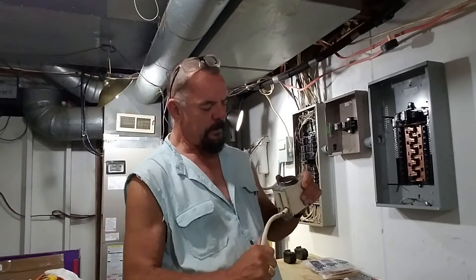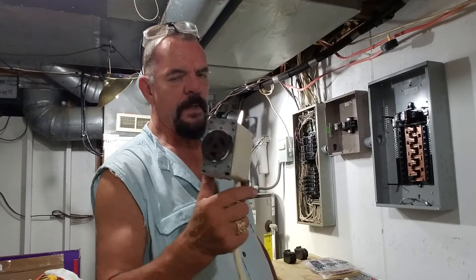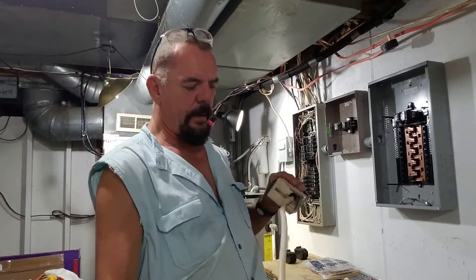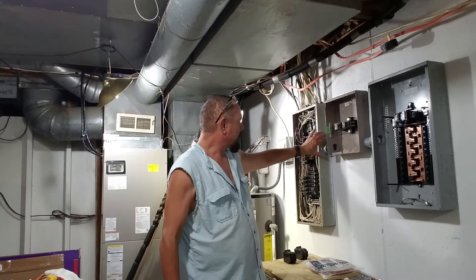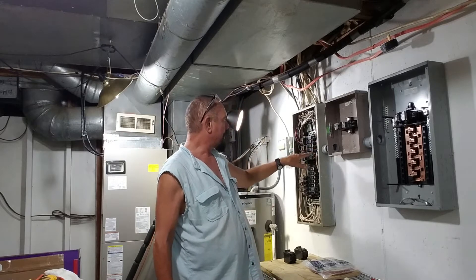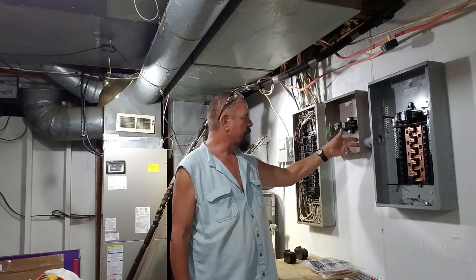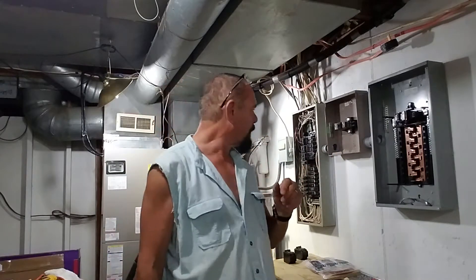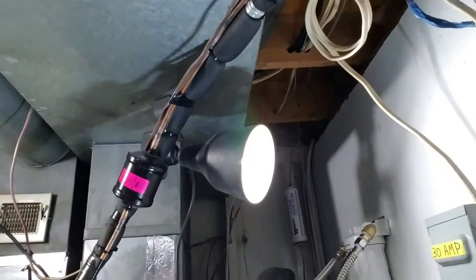I don't know if he used it to back-feed or to put energy out to the garage — Romex 10-2 or 10-3 or whatever it was I've got up there. This thing here was piggybacked on a 30-amp breaker and I said, that's going today while I'm in this box, because I had to get in there to drill a hole. There was no knockout in that location. I wanted to go from here to here — and I drilled a hole in the sub-panel. Let me bring you close because I have something to show you. It was disturbing, to say the least. God must have been smiling on me because it could have been a big deal.